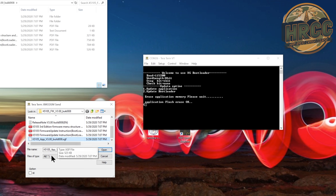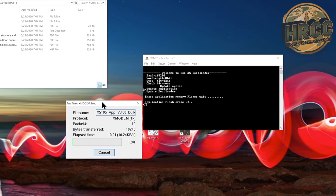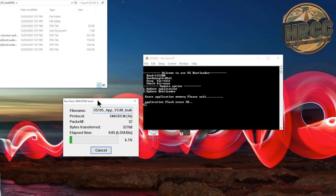Most important step before you click Open: click the 1K option. You need to have that. If you don't, it's going to go slow, and I've actually not been able to load the firmware twice by not having that selected. So then you do it and it should start going. You let it finish its job. Without 1K selected, it would be transferring at a much lower rate — less than 8.7 kbps as it's showing right now — so make sure you click that.